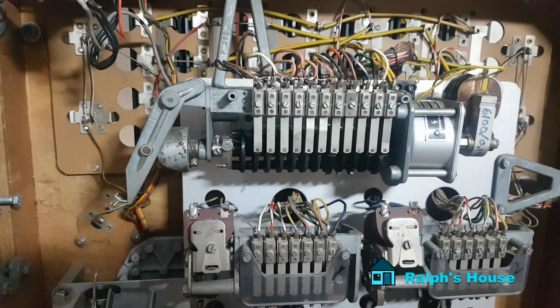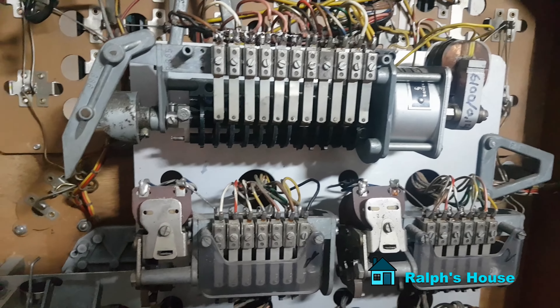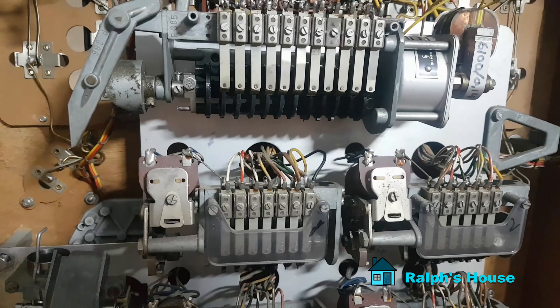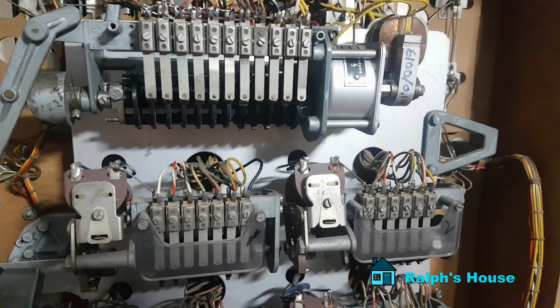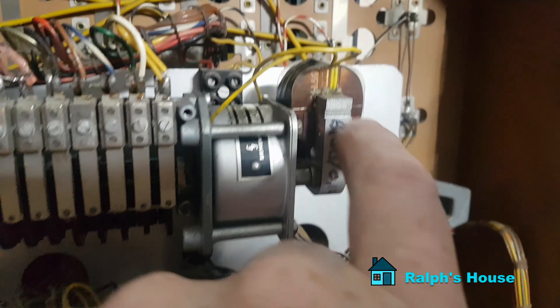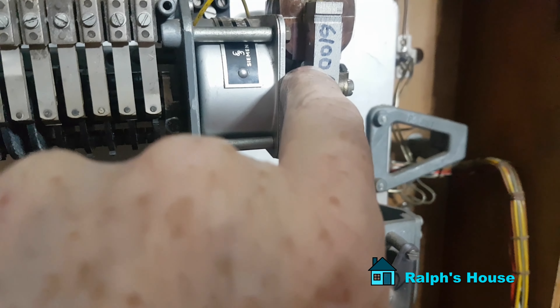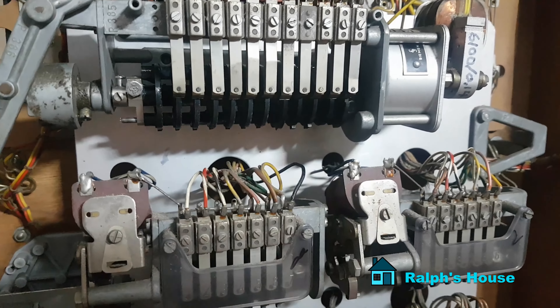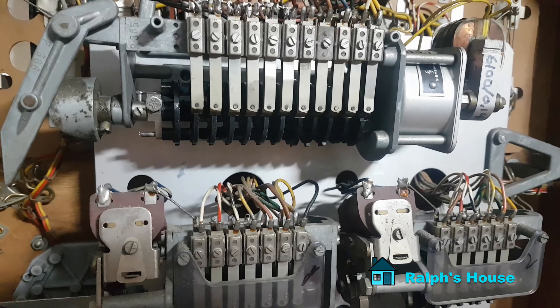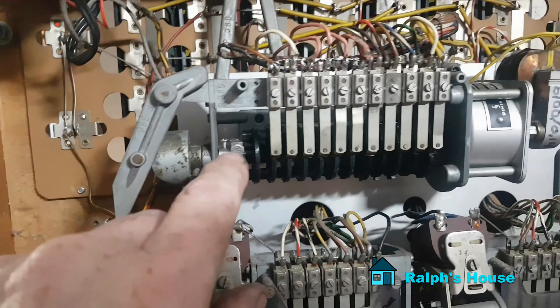Let's have a recap of what I've done today - an awful lot, and a lot of it has been a real learning experience. First thing I did was repair a broken wire on the windings - luckily it was on the outside, having been nibbled by a mouse. I wrote down how many turns: 6100 at 0.14 gauge wire, if anybody ever has to rewind that. Very fortunate the motor was in good working order. The same could not be said of the cam - that's gone over a few episodes to sort out. Looking at the original Gunter Wolf wiring diagram, which does tell you how many teeth are on it, I was a bit late in spotting that. So I've 3D printed all of them.